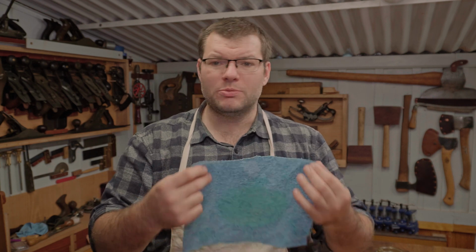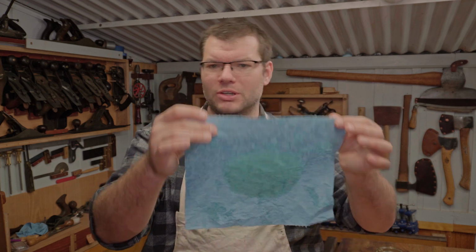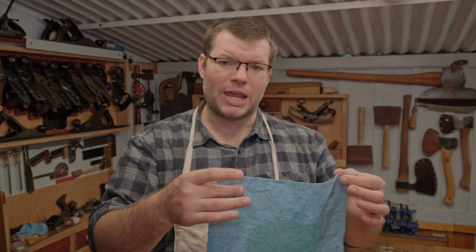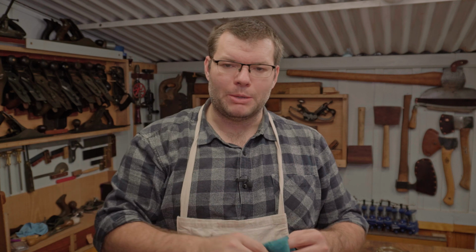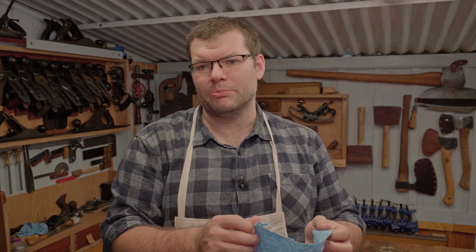The other thing you could do is put it into a metal trash can or into a pot or a jar of water. And if you fully submerge it in water, it's not going to combust. And you could just throw it out in a container with water. If it's an old plastic container or something with a screw lid, you could tape that up after you've filled it up with your rags and water, and just throw that in the bin, and that won't cause a problem either.